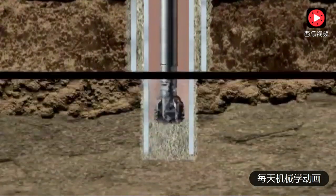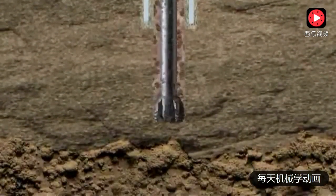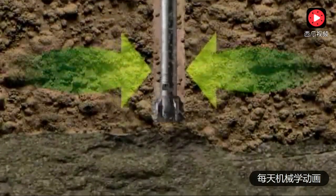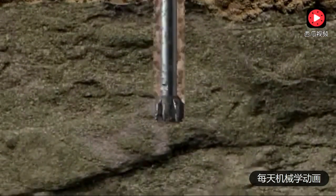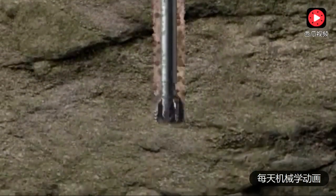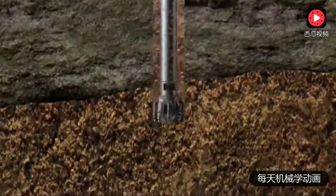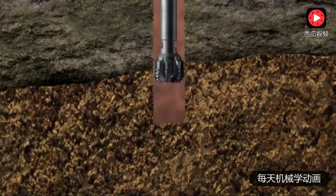The density of the mud is controlled by the mud engineer, adding dense minerals when needed. The aim is to produce a column of dense mud which exerts sufficient pressure in the well to counteract pressure from fluids encountered in the rock. This combination of the dense mud column, contained in properly cemented casing, aims to control pressures in the well. The BOP provides a further level of security. When the well penetrates a potential reservoir rock, the oil or gas may be detected by analyzing the drilling cuttings for traces of gas and or oil.